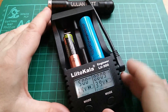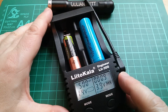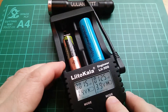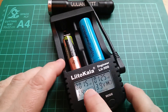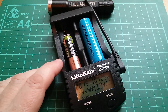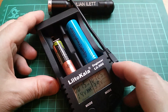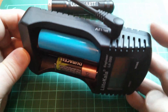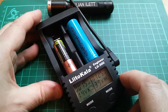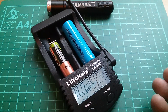So with all these features and no unnecessary features, I think this could become my favorite battery charger. It's also a pretty reasonable price — on Gearbest at the moment it's US$20 with free shipping to the UK. Just a question mark over the internal resistance test: on the nickel metal hydride I got 15 milli-ohms, on the lithium-ion 125 milli-ohms — that just seems a little bit suspicious. So there it is — a quick first look at the Litokala Engineer Li 300: a two-slot battery charger, 12 volts in, 5-volt USB out, nice and simple uncluttered user interface, very simple to use with the single mode button, backlight, features you want, no features you don't want. I really like this battery charger.